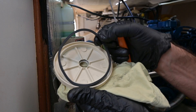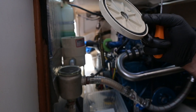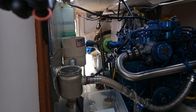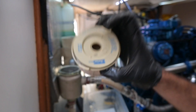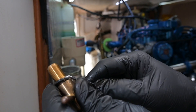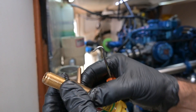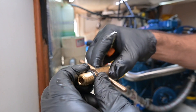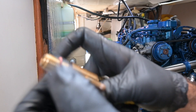This kit comes with a new O-ring seal for the topper, which I've just pushed into place. And there's also a new O-ring that comes with the kit for the T-handle. I'm going to replace that. Then there's our new filter, which we're going to push into place. I'm just trying to take the existing O-ring off the T-handle without destroying it, because it looks quite different in shape or profile. I'm wondering whether it's just been distorted with pressure. There we go — yeah, I think it has. I'm just rolling that off. That's the old one, that's the new one.